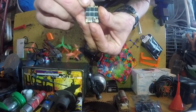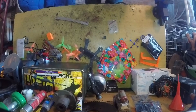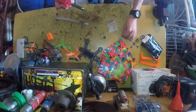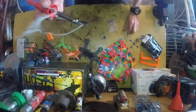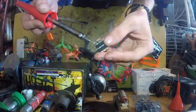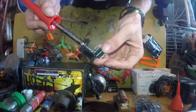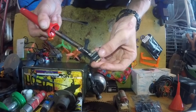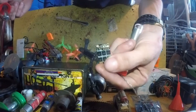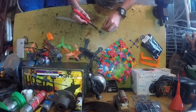I got it scraped up. The coating has been taken off there. Let's go ahead and tin it up. I'm just going to hold this one up for you on the first one just to show you how easy it will take. This is the negative side here. And just a little drop is all it needs for the little signal pad.